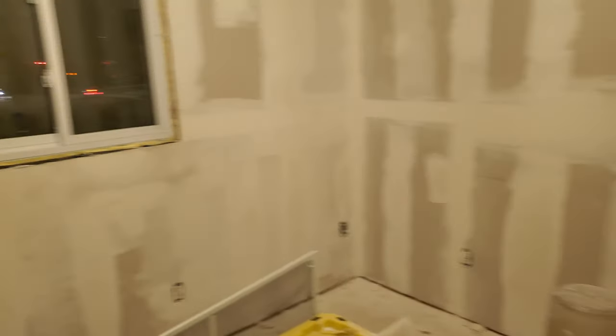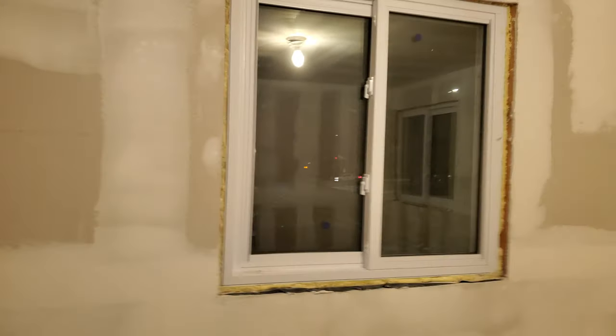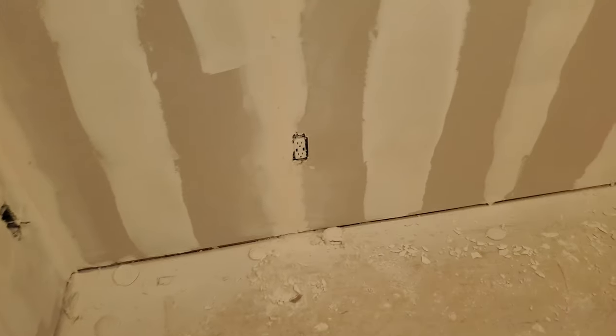They're not me, so I shouldn't expect them to do it exactly the way I would have done it. All I have to worry about is that it gets done, and it does look like we're making progress. It looks like they cut a bubble that used to be here, or maybe they've just smoothed it over — just slapped on a bunch of mud over the rumpled-up tape. They're rolling on the mud, that's how they get those lines. That's why it's efficient to do lines instead of other methods, and why they're leaving those bubbles.